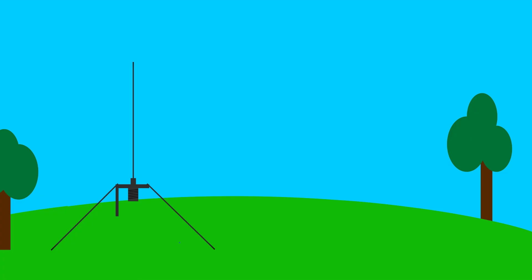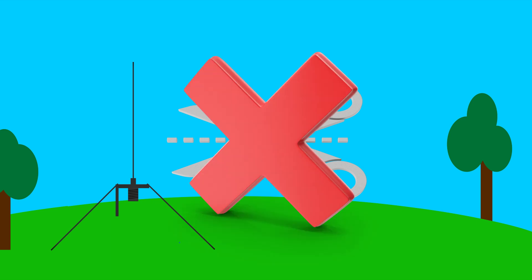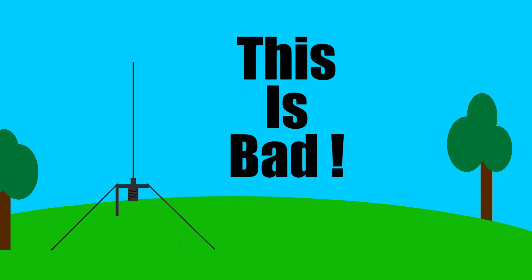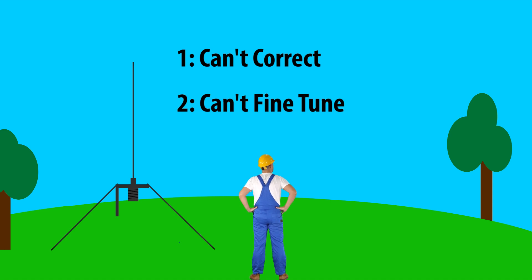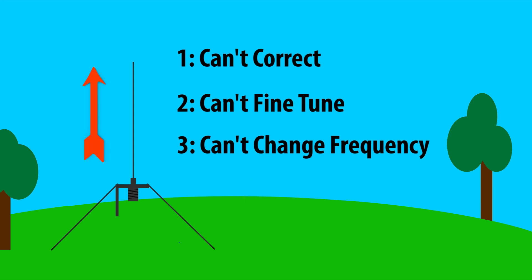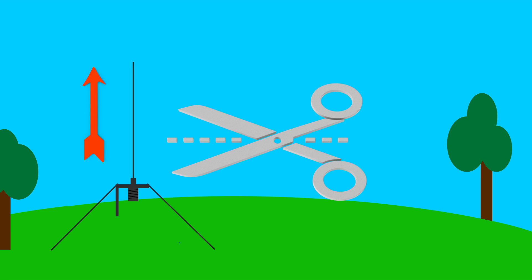The most important part about buying an FM antenna is that it must not require you to cut the antenna. Some cheap antenna sellers will give you an antenna that needs to be cut to the right length to match the transmitter frequency. This is very bad for three reasons. One, once you cut the antenna, you can't put the length back, so if you make a mistake, you can't correct it. Two, you can't fine-tune the antenna. And three, even if you by pure luck cut it perfectly, if you change your transmitter frequency to a lower frequency, you won't have the length of antenna to reach the correct wavelength. This is because lower frequencies have higher wavelengths, which means a longer antenna. So never buy an antenna you need to cut.